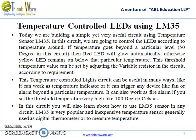This threshold temperature value can be set by adjusting the variable resistor in the circuit according to our requirement. This temperature controlled light circuit can be useful in many ways, like it can work as a temperature indicator or it can trigger any device like fan or alarm beyond this temperature. It can also work as a fire alarm if you set the threshold temperature very high, like 100 degrees Celsius.